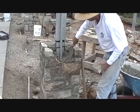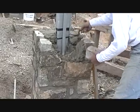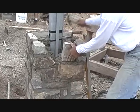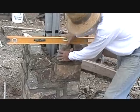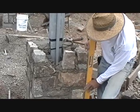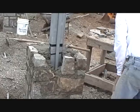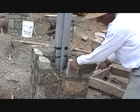We are laying stones on the pier. These are real stones and this is granite. So we put our stone in just like this. We are going to level it — this is the top of our pier. When we level our side we level it this way. This is two-to-one cement, all Portland — two sand and one Portland.